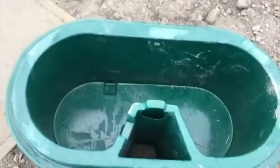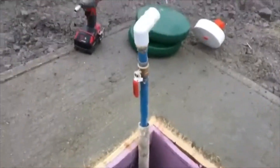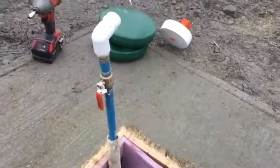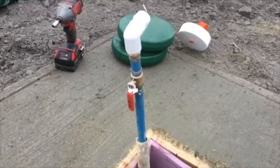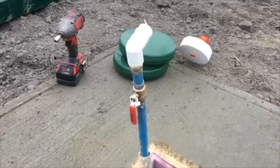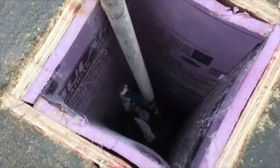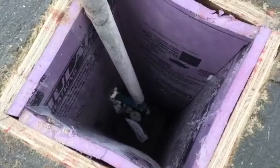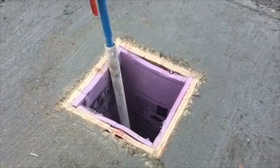We've got the water with the lid off. The water pipe will come up through there, attached to the float valve through that hole. The shortcut on installation is to go ahead and put your elbow and your adapter on there with a shutoff valve. We opted to use a PEX shutoff valve, adapted straight into that elbow, and we'll attach it to our float valve. Make sure you keep that hole wide open all the way down deep in the ground — that way the heat keeps the water warm in winter and cool in summer.